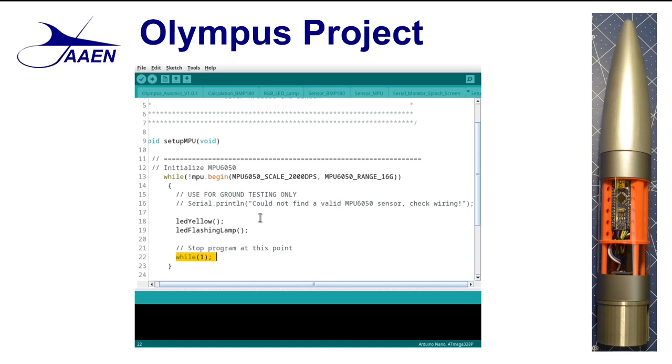You may also notice that we used four different colors during this process. If everything initiated properly, it got a green light and the LED went to a steady state. If we had a problem with our SD card, it was red and flashed. If it was a problem with our pressure sensor, the color changed to blue and was flashing. And here with our MPU 6050, if there's a problem, it changes to yellow and flashes. By using these color codes, we don't need to have the computer hooked up to see what's wrong with the system — we know simply by the colors where the problem is, and we can work on correcting it.